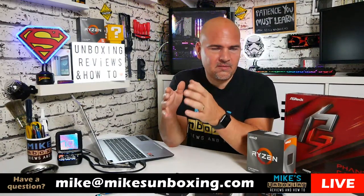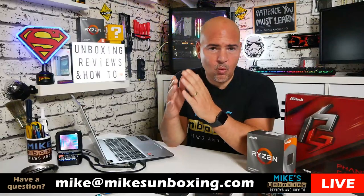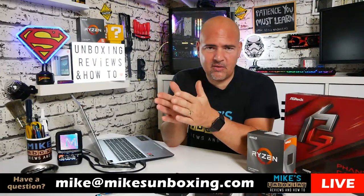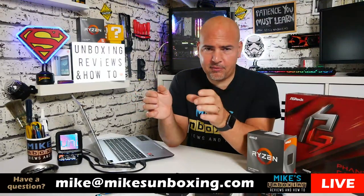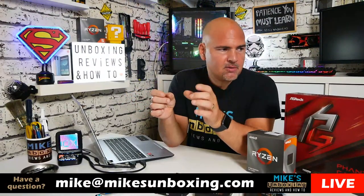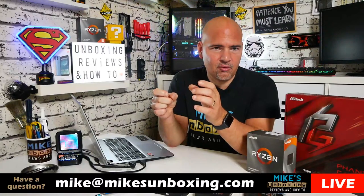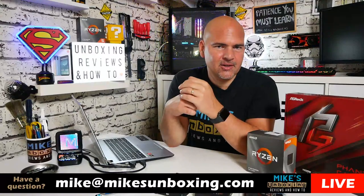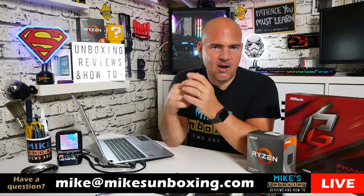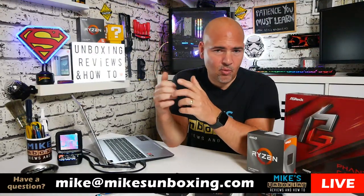So what they've done is most of the boards now have more VRMs. They basically split the power delivery up into multiple channels. Rather than being either three or four phases, most of the boards now, even at the entry level or the lower mid-range, generally tend to be five, six or more phases.